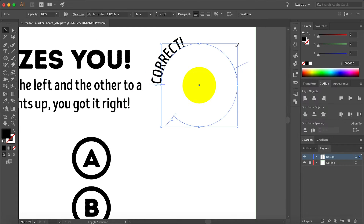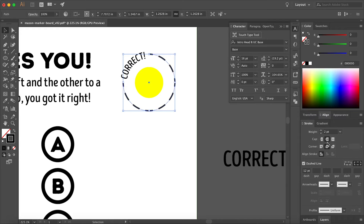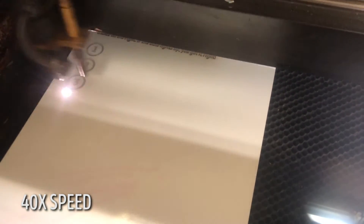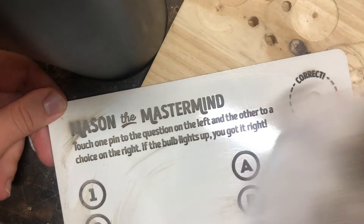The last step was designing a little area for the light bulb to go. I sized the hole to correspond with the size of some mini bulbs I bought on Amazon for this project. Just in the nick of time before lasering, the perfect title for the board came to me. Then it was time for everyone's favorite part, the laser cutting itself. I broke my file into a few separate raster jobs to save the laser time by not having to travel over a lot of open space — had I done all these at once, the laser would have had to travel that large gap of white between the questions and answers side for every single horizontal pass, resulting in a longer etching time. After etching the marker board, a wet paper towel was all that was needed to clean up the residue left from etching.